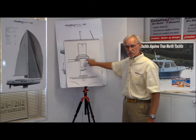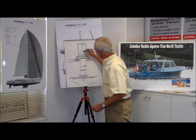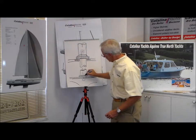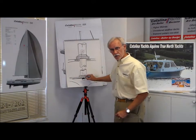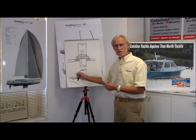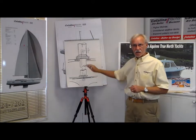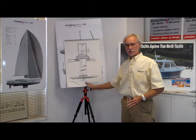No opportunity for water to get into the boat. And we have a wire chase that goes through here. Most of our boats now have a stand pipe inside, so the wires enter and go down through here, and there's a stand pipe inside the compression post. The wires come down and exit through the bottom of the plate at the bottom of the compression post, through the stainless steel beam. We usually weld a ring right here so that the wires as they come down and turn out have a chafe-proof surface, so you can easily lead another wire through the mast and up through the compression post. All the masts we use now have access plates on the side, so you can remove the plate and reach in and grab the wires. I think it's the highest evolution of this system we've ever done — it's leak proof, and structurally it works extremely well because you resolve all the loads right down to the keel, metal to metal.